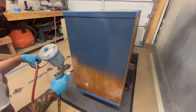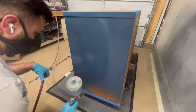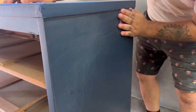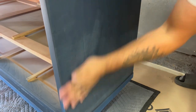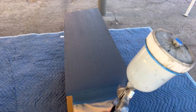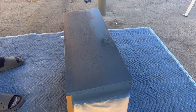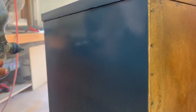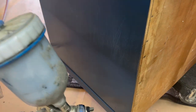I get a lot of questions about the spray gun and my entire setup. I don't know the brand off the top of my head but I have it listed in the description with everything else I use — I got it from Amazon for about $50 plus tax and shipping. This has literally been the only gun I've used since I started flipping furniture, which has been close to a year and a half now. The key is to clean it really well after every use. I have it set up with a 10-gallon California Air Tools ultra-quiet compressor. I would like to add an extension tank because it does run out of air fairly quickly and tends to run a lot, so keep that in mind — get a big compressor.